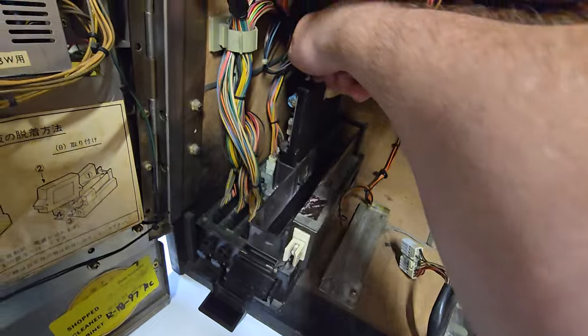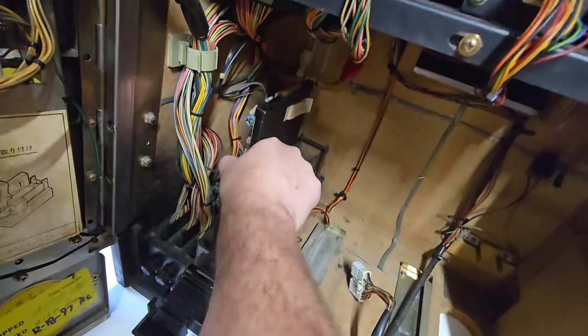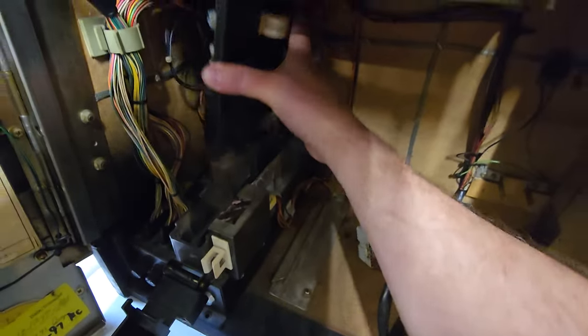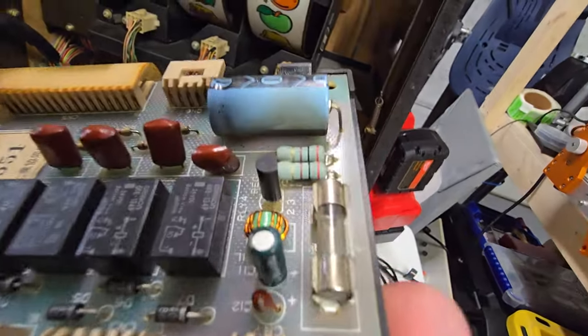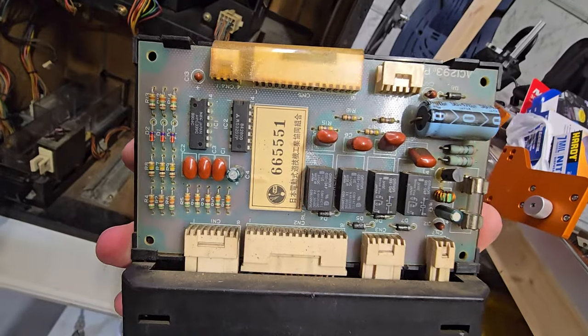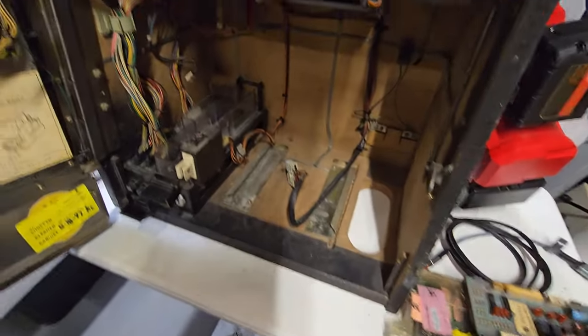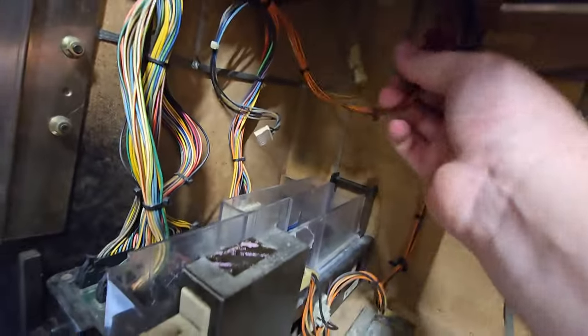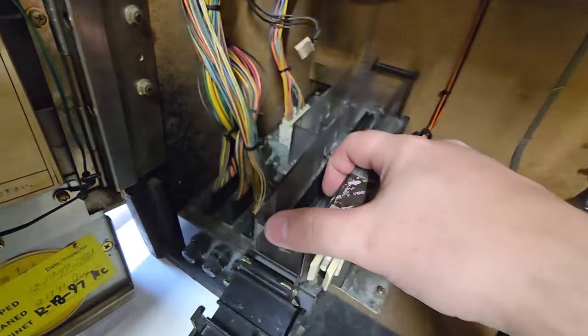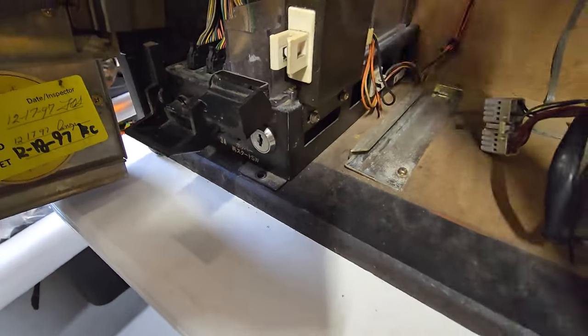You can see that there's maybe a little bit of heat by that electrolytic capacitor right there, but it appears to be good. So far I can't even prove that I have DC power. One of the things I'm really concerned with is where my DC rails are and how I'm going to measure those. And all this guy down here is is a breakout board — you can see underneath it. I'm currently going through the cabinet and fixing some things up.